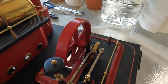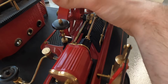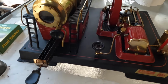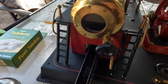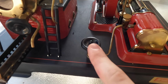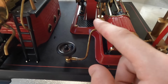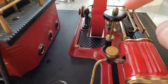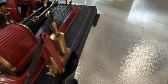Here's all your valves, or the piston setup. So, a few interesting things about this. It has a blowdown valve, which you shall see when we're putting this engine away. This is the regulator, steam valve for the piston. This is for your steam oil. Little toy governor that doesn't really act as an actual governor. And even a water pump that puts water into the boiler.